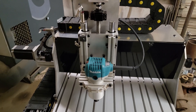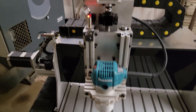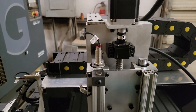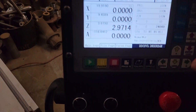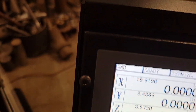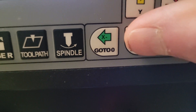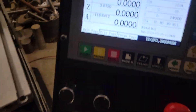For example, if I want to zero the Z out at the upper limit and make that my machine home position, I can run it into the upper limit, switch to MPG mode, crank it down until it comes off the limit, back it up a little, then press shift and go to extended keys. The extended key for Z is zero. Push it once, push it again — now the Z is zeroed out.